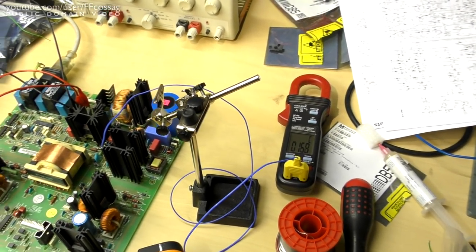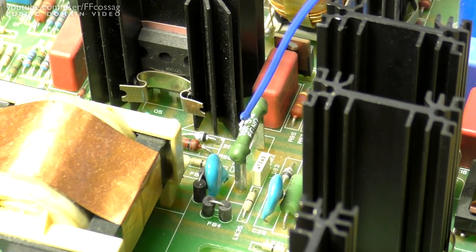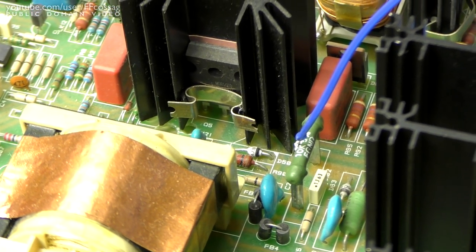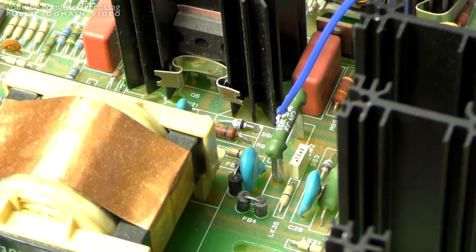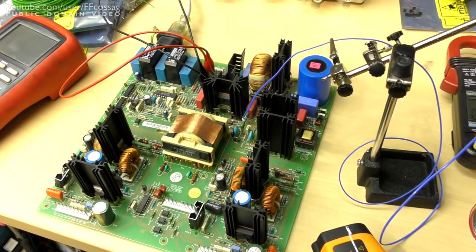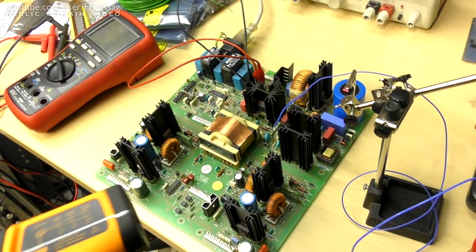And many of the data sheets I found for similar resistors hint at a temperature rating of about 350 C, and we are nowhere near that. The lowest temperature rating I've found for any power resistor has been 175, so we really are quite safely within the specification of this resistor. It's going to be a brand name resistor, so I wouldn't expect anything less than 250 C rated. So I'm almost tempted to put this unit back together and actually give it a go.